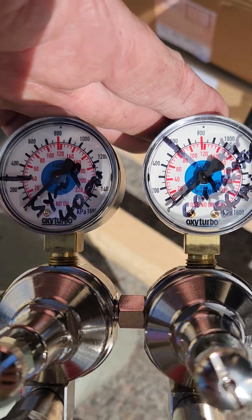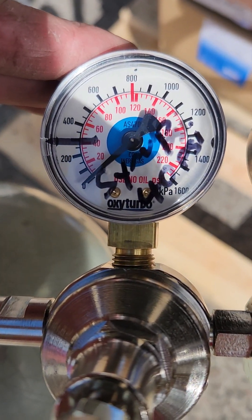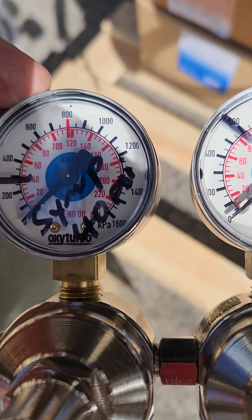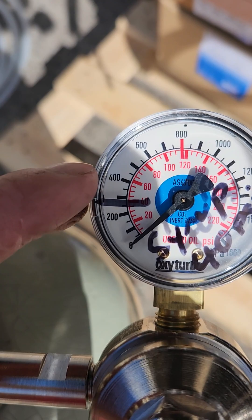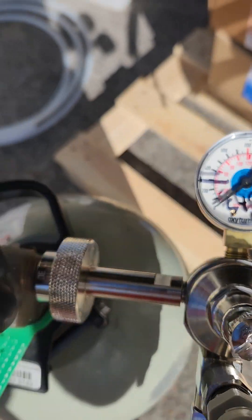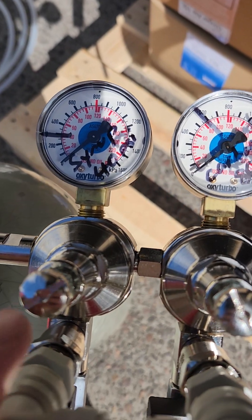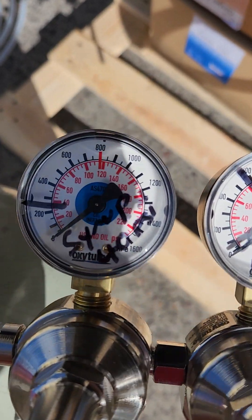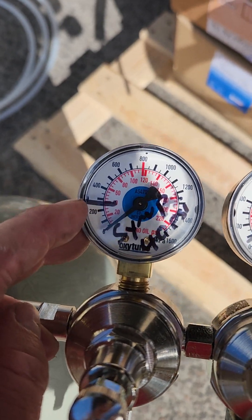These two need to be adjusted. The first one here is your syrups line — I've written 'syrups' on it and written 40 PSI. PSI is the inside red one, and I've drawn a line at 40. So once you turn the gas bottle on, take a flat head screwdriver and wind this spindle inwards until the needle gets up to 40.